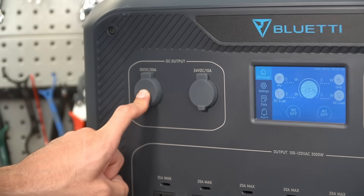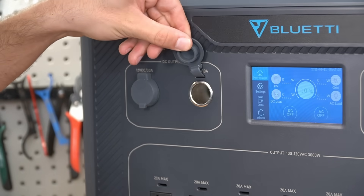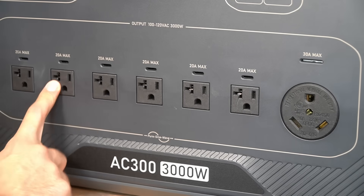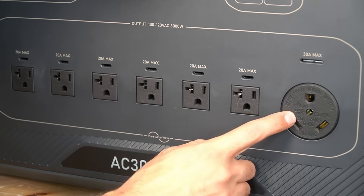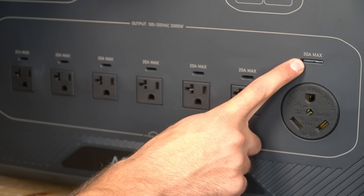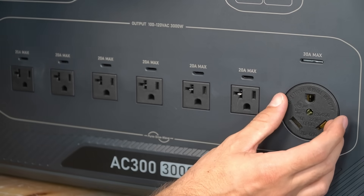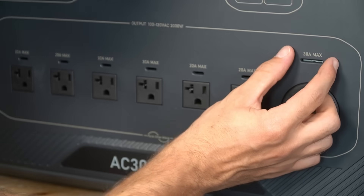On this model you have a 12 volt and a 24 volt output, and at 10 amps that's 240 watts. Now let's talk about the inverter output receptacles — we have standard receptacles and an RV plug. Whether you use either one, the max continuous output is 3,000 watts. I think they should have labeled the RV plug as 25 amps max, because 30 amps times 120 volts is 3,600 watts, but this inverter can only output 3,000 watts — so you'll never get 30 amps continuous.